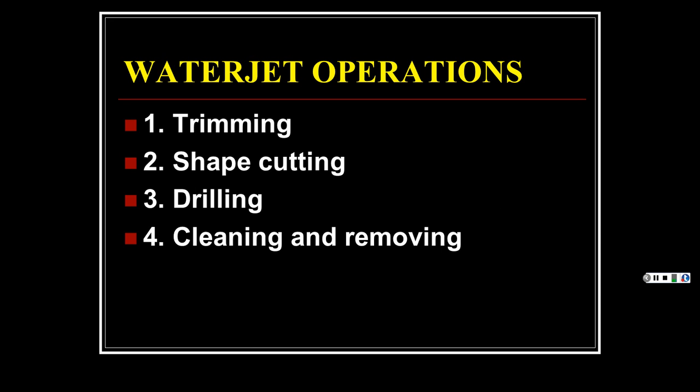Like I said, they were cutting out blanks, and they could cut out the state of Texas. And nice. I've got some pieces in my office. I need to bring them in and show them on this video, but you really can't see it as well as actually seeing it. So next time you're in my office, I'll show you all the different ones. I've got an object that was cut by laser, one that was cut by this water jet. With water jet, it comes in real smooth, then when it comes out, because it's breaking down that water stream, it comes out with more of an angled bevel on the outside edge, depending how thick it is, you can see it. Then I have EDM wire, then I have a stud welder thing. So I've got a few little examples, so next time you come by, you can look at all that good stuff.